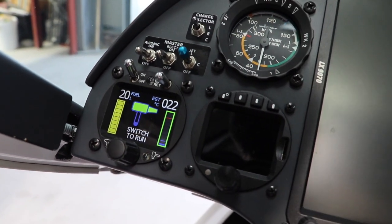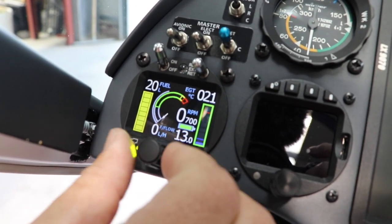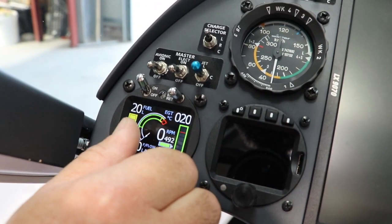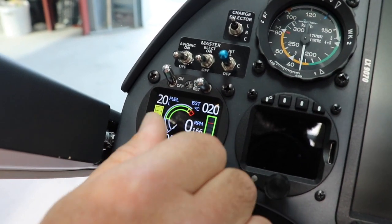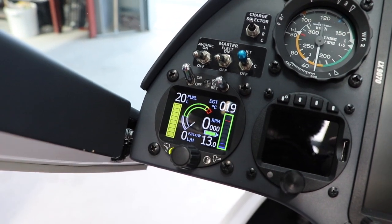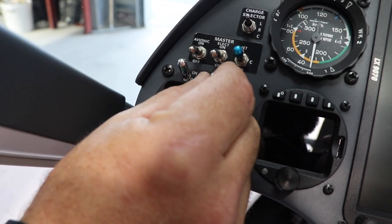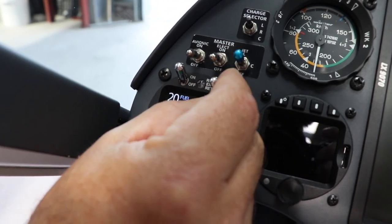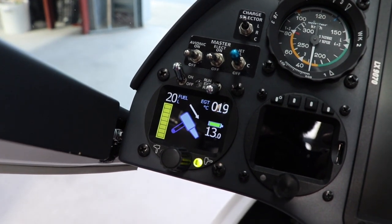To switch off the system is very simple. You just go down to the throttle position — as you can see, the bar on the outside is maximum throttle, and that is idle speed. If you are on maximum throttle, good practice is just to come down to idle for the engine to cool down for a while, and then you just move the switch — the master switch or main operating switch — into the retracted position. Once it's cooled down it will automatically retract and slow the engine.